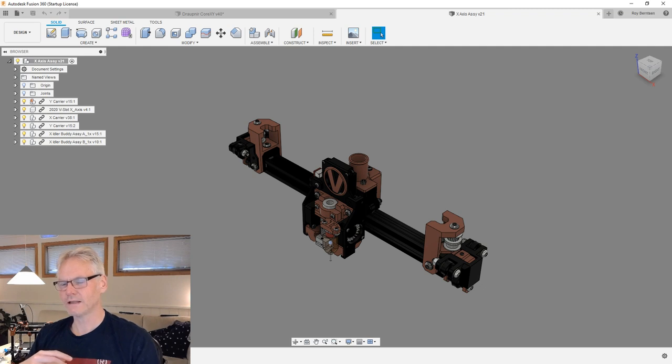The pressure advance, I think, is really a hassle to tune on a long bowden printer, but at least now it's working fine. And there are lots of nice features with the Duet. The controller is very nice, the board is just beautiful, the firmware is a little bit... I think Marlin is much more well developed than the RepRap firmware. RepRap firmware is kind of like a development base. It's never final, it's never released, it's always a new release, you know. But yeah, it's nice, but expensive. Of course, the fine thing about the Duet is we have built-in Wi-Fi, so that's very nice to have.